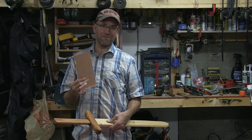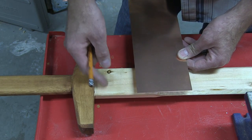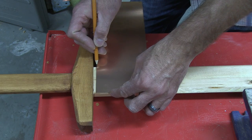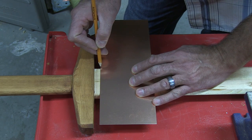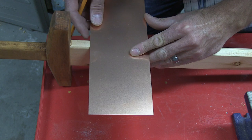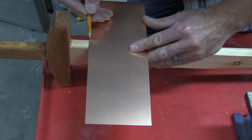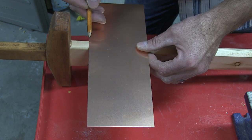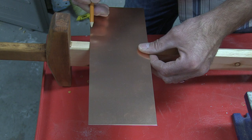Let's start by getting this out, marking it, and shaping it. Instead of getting my tape measure out, we're just going to do a little bit of cheating here to see that we've got enough material. We'll move it up, do another mark, and on the edge we have a thickness of three-quarters of an inch or 19 millimeters. That is what we actually need, and then we're going to go another inch just to have extra to play with. I'm not going to cut it just yet — I'm just going to mark it.